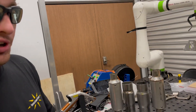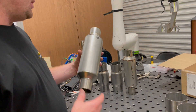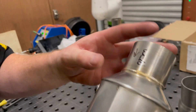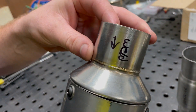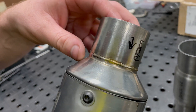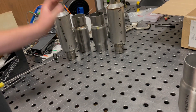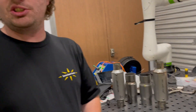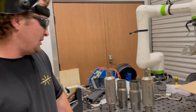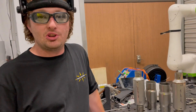I'm going to show you some different kinds of ways of doing this. Here is some testing we've done using modulation with the laser — we're pulsing the laser at a set amount of times per second. We can vary that and it'll change the appearance of the weld, but I'm going to stick to one of those and then give you a smooth example also.